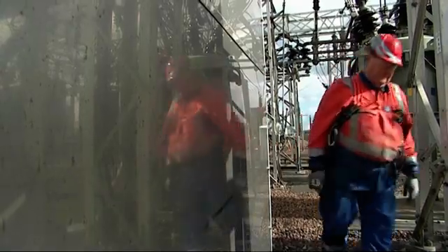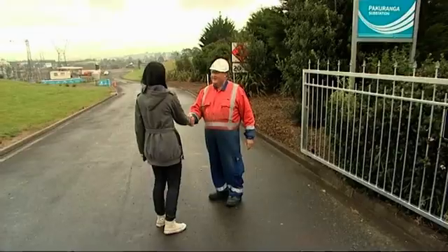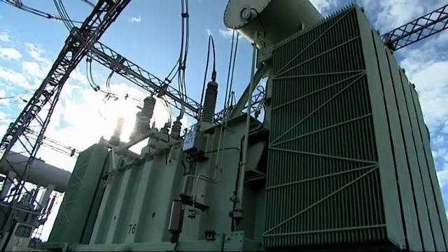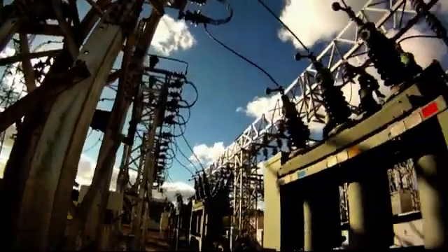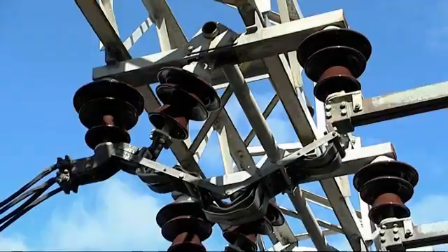Training manager Keith Ball will be guiding Vi through her first day. Substations are necessary in the electricity supply system to lower voltage for onward distribution into a town. This station drops the power from 110,000 to 33,000 volts. Our job today, Vi, is to carry out a service on the switch.